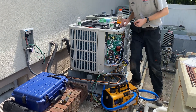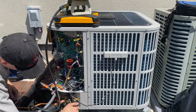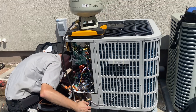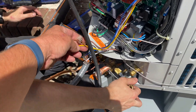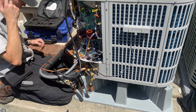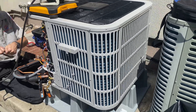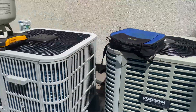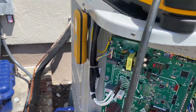That's the problem when you've got these older line sets - inch and an eighth - and you had that cross-contamination with 410A and R22. We flushed it out with the X11 flush and used a pipe wiper on the three-eighths. You can only do so much. We're at 798 now, slowly going down - 797 - but it is taking its sweet time. Rome wasn't built overnight.